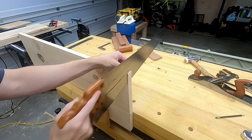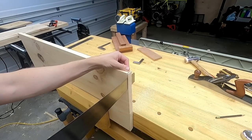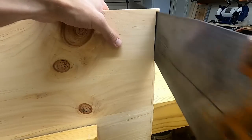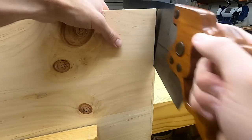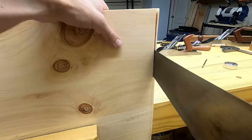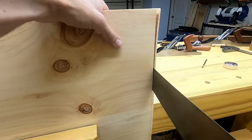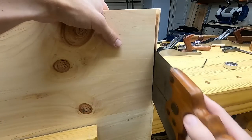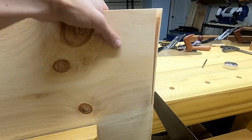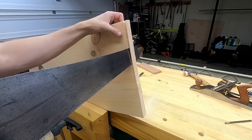As I saw, I'm trying to stick right next to the line on the waste side. Small adjustments are being made as I saw to keep it next to the line. This saw, by the way, is 20 or 22 inches long and it's 10 points per inch, meaning there are 10 saw teeth per inch. As with the last upload, I'm not cutting much out of this video of the work — you get a full look and good comparison of using hand tools versus the machines.